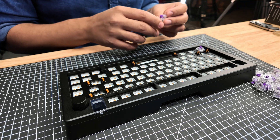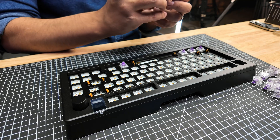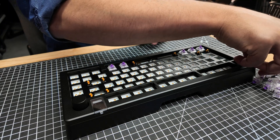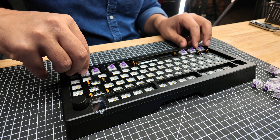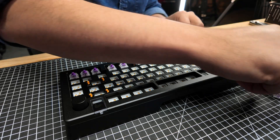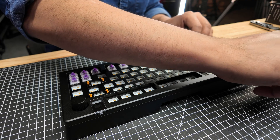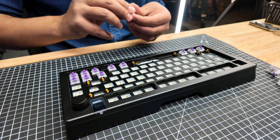These are not hall effect switches. What they do is when pressed down, you can see the spring leaf in there — it completes the circuit once fully pressed, sending the electrical signal across the PCB to your computer. Hall effect is a little different — it uses magnets, and depending on how far down you press, it changes the voltage that the hall effect sensor receives. That gives you more customization for input, so if you do a light press or want rapid fire settings, it allows for those kinds of configurations with companion software.